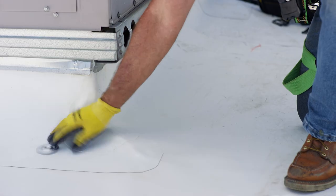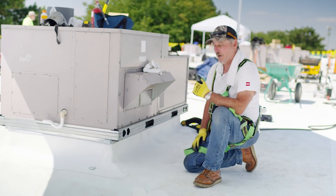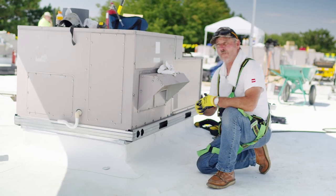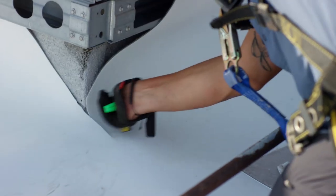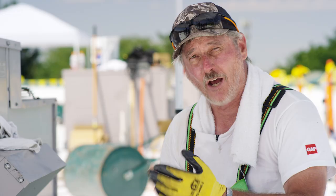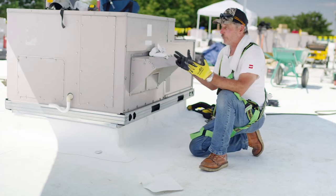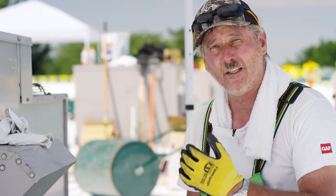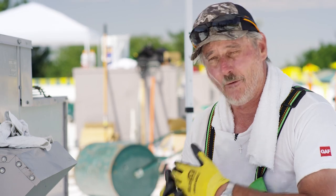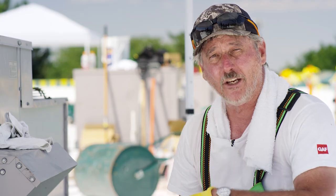On the two opposing ends, we put plates and screws. You might ask, why do that? Well, you don't have to do it this way, but why cut this material off and get rid of it when you can utilize it? Cut it flush here and just do a standard flashing if you want to go that route. A quick way to do this — if every unit is identical, which they pretty much are on this roof — you could have them pre-cut and ready to go. The guys doing detailing aren't wasting time cutting; have somebody pre-cut them, give them a flashing, and there they go.